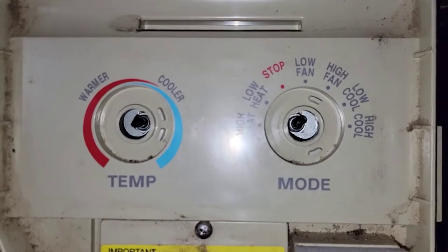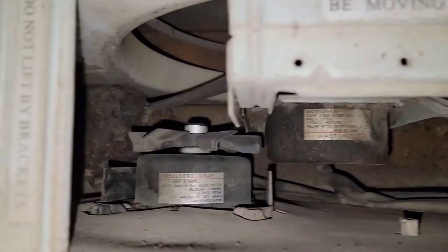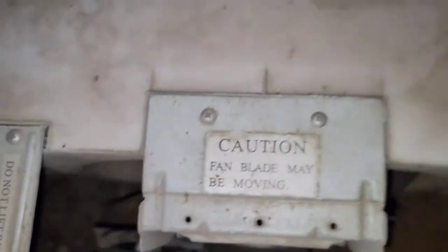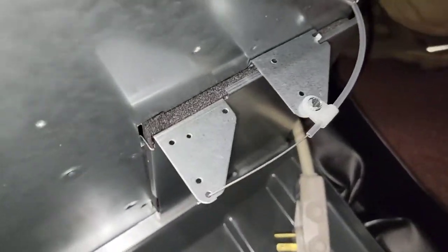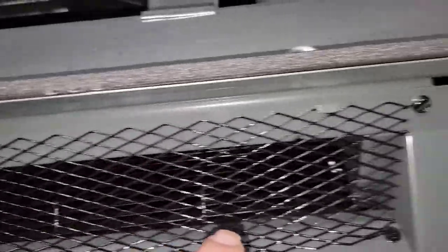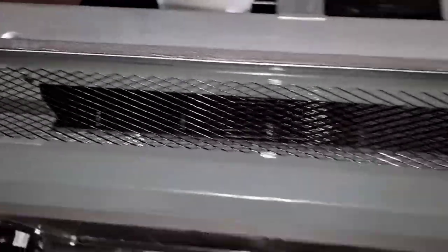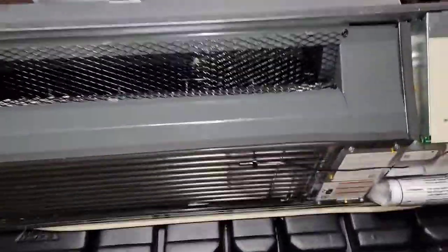This is the old dial here, old fan motor — you can see that there's actually a motor there. You can't see that on the new one. Then there's your fresh air panel right there. I'm impressed — it looks really nice. The blower wheel is different. You've got the blower wheel that spans the whole entire evaporator length, and then on the new one you have a different type of wheel — it's like a mini-split air handler, which is very efficient.